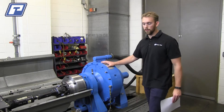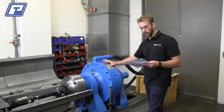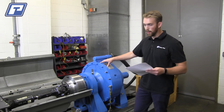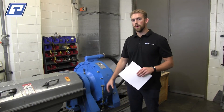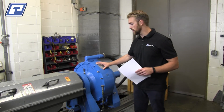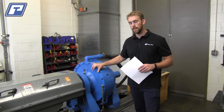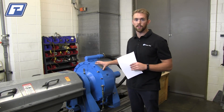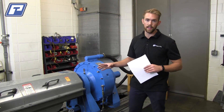Finally, and you can do this on a more frequent basis, just ensure that your dyno is calibrated correctly. We have tech tips available for calibration for your torque, temperature, and pressure in our tech tips section, as well as in your owner's manual for PowerNet and your F-Series engine dyno. We also have requirements in place for long term storage — defined as anything sitting for over three months — to prevent corrosion or any other damage. Those requirements are outlined in your owner's manual.